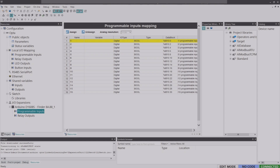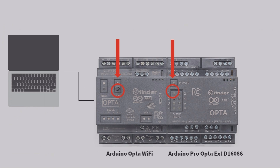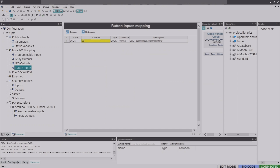You can add variable names to the inputs and outputs. For the programmable inputs, you can choose whether to use them as digital or analog. For the relay outputs, you can add variable names — they are of Boolean type. I'll write a PLC ladder logic program using the user button on the Opta PLC to turn on one of the relays, and use the output status LEDs to verify it's getting activated. Go to the relay outputs and give it a name, for example 'relay_one'. Then go back to the Opta PLC, click on Local IO Mapping, click on Button Inputs, and give it a variable name of 'user_button'.